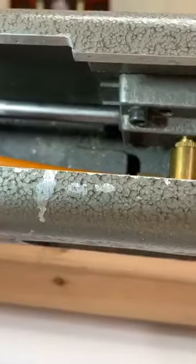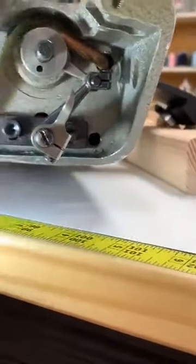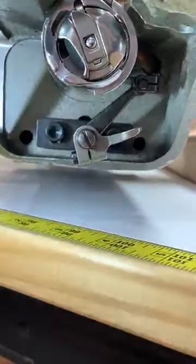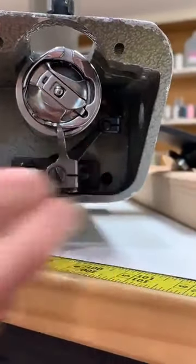That shaft is run all the way through the bottom of our machine. And it goes down, it goes through this bushing, and then it comes out in the front of our machine down here. So let's shoot right straight in here and we can see. I'm going to show you how this works with our rocking finger. There's a little cam down here where that shaft comes through, and it drives our rocking finger right here, a little eccentric cam. And then the shaft comes back out right there, and this of course drives our hook and race assembly right here. And then our rocking finger goes up in here and does this job.